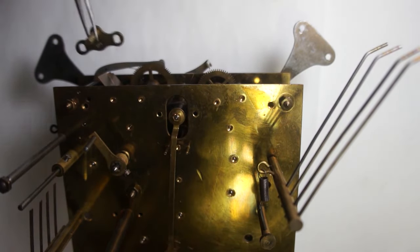So I've got the cardboard removed off the back, but the reason the latch is so loose is because all of these fasteners, this is a nail with a head on it. This looks like a finish nail, really small brads, and these are nothing more than needles that have been cut off and inserted in there, but they're all just so loose that they can be pulled out with tweezers, and that's why the latch was so loose.